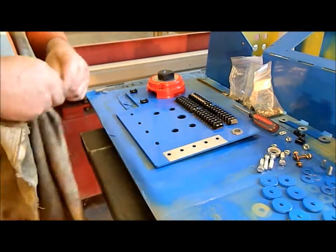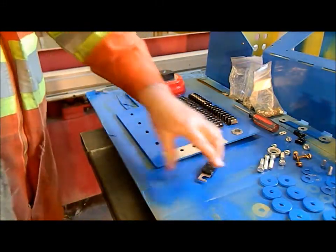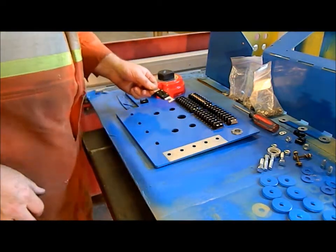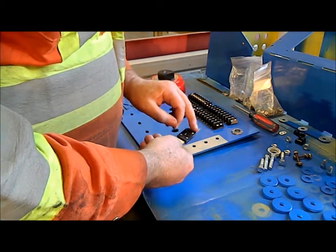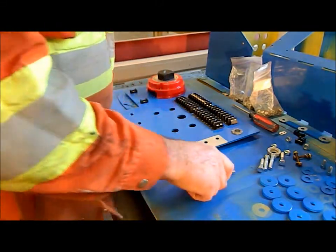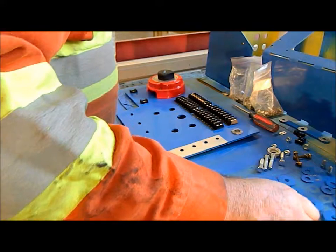There's supposed to be a 100 amp fuse on the small hydraulic pump and a 300 amp on the large hydraulic pump. So you saw right at the beginning, the video showed it had the one fuse on both. So I have no idea what this rating is because you can't read any of the markings anymore. And you see how badly butchered up it is. So it'll be the same type of fuse, but one will be 100 amp, one will be a 300 amp.